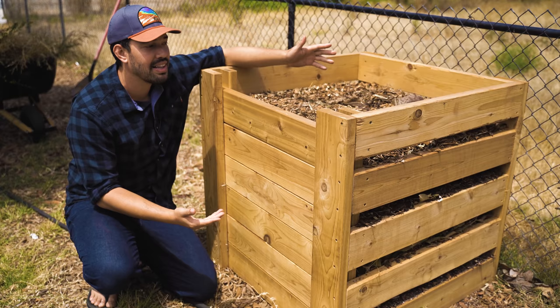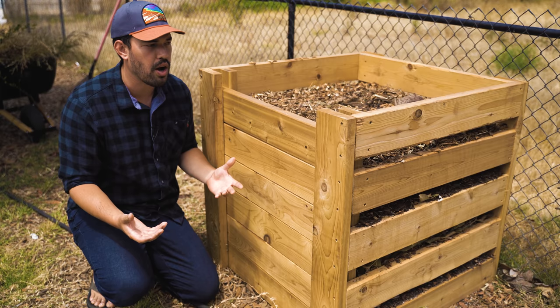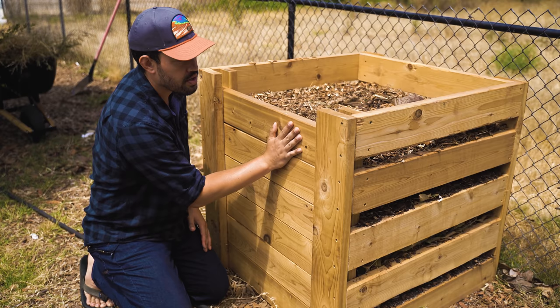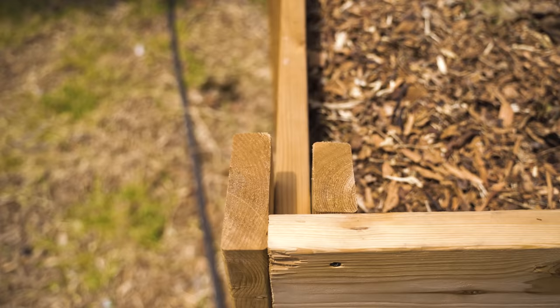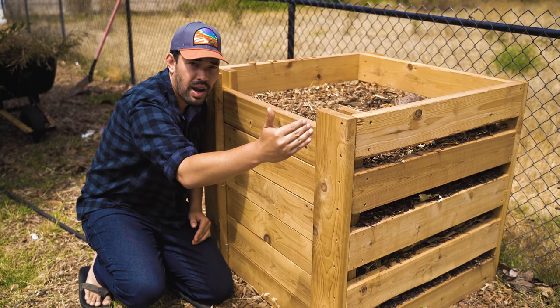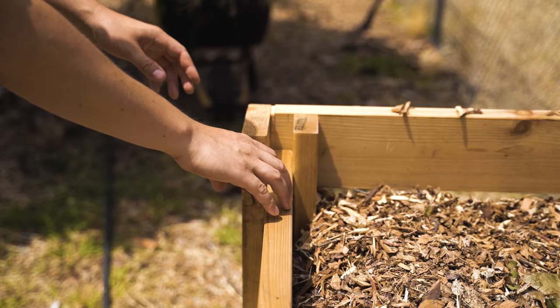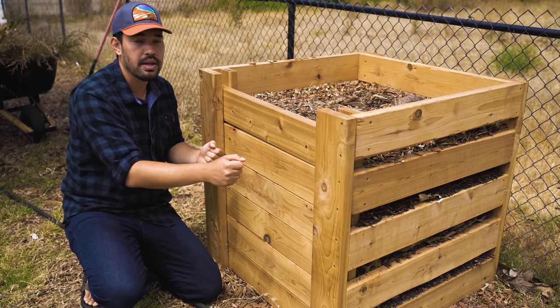Update number one is that the compost bin is full and clearly too small for the property. I think this example of a bin is great for the average backyard gardener, so I wanted to give a quick overview of how it was built. It's almost exclusively cedar two-by-six — here, here, here. The only two-by-fours are the ones holding in these slats. It's basically building a cube out of two-by-sixes, leaving about an inch and a half gap for airflow. You could put chicken wire around those edges to protect from rodents or material falling out. The only special part is the slatting, which lets me come in and turn the pile easily, dump it out easily, pull stuff out, put stuff in.